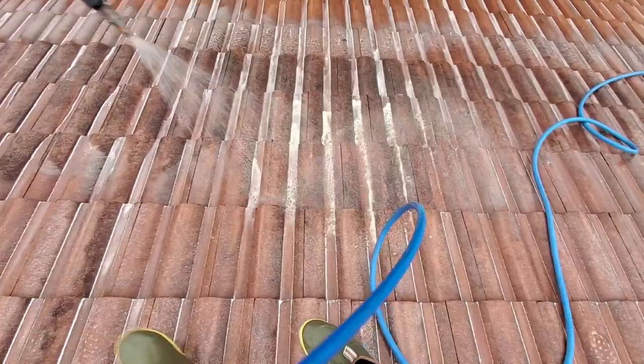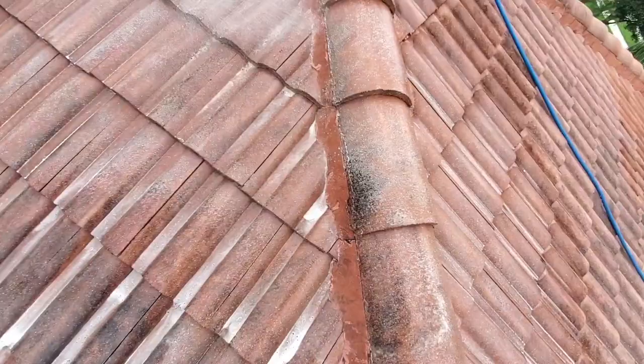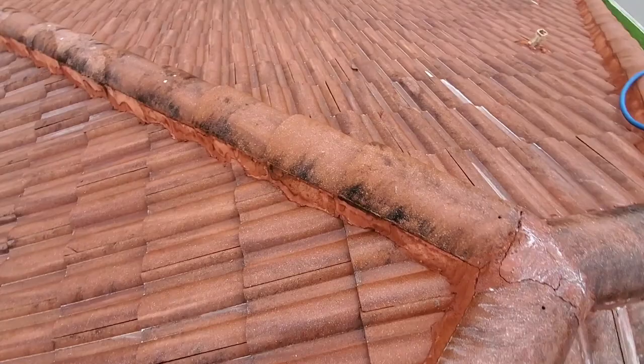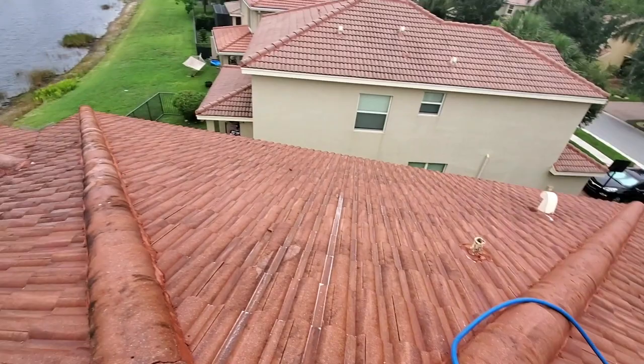You can see it's cleaning up nice — at the bottom edge it's much cleaner because I went around and hit all the edges first. That's just something I like to do. The edges of the tiles — the faces of the tile, the ridges, the ends, the sides — I like to hit those first and really well because that's what the customer sees and it's the most difficult part to get clean with barrel tiles. I like to hit them first, hit them good, and let the solution clean up while I'm there so I know what I need to touch up before I leave.